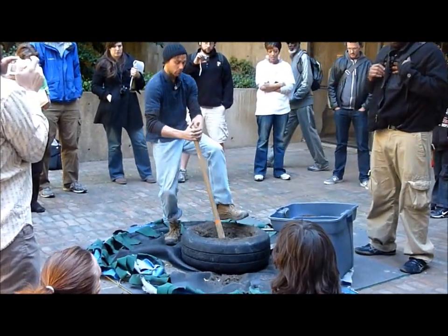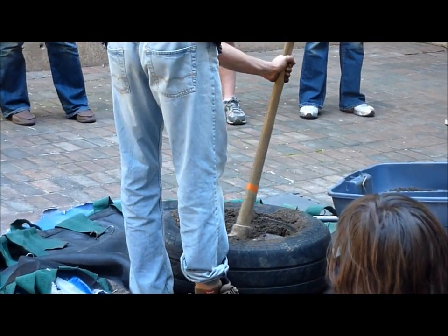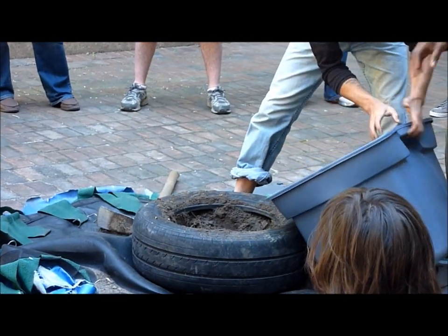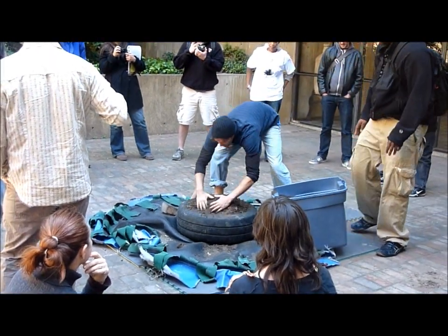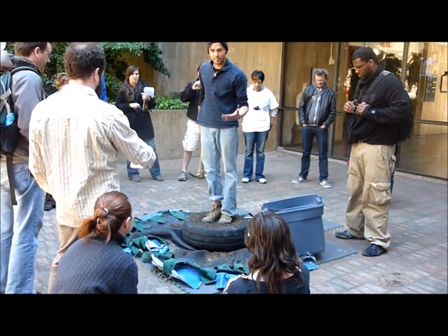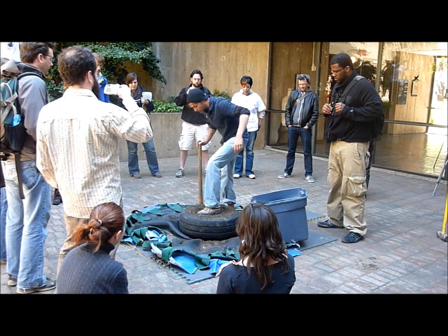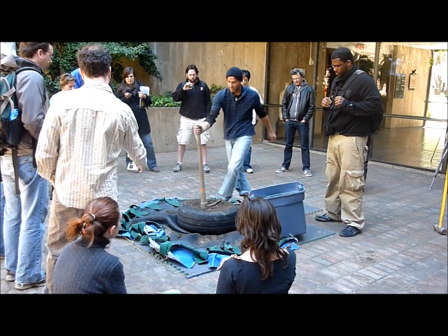The whole goal is to get as even a fill as possible, so that there's no real voiding. Kind of going around, pushing that dirt in, add more dirt. I usually just step it in — the weight of myself compresses it. It might seem like I'm negating what I said about not compressing the middle, but I want to get down so I can bring up that sidewall again, and it's a lot easier to just kick that dirt right into the sidewall.